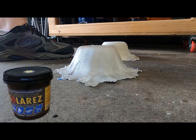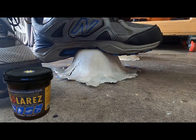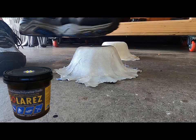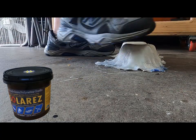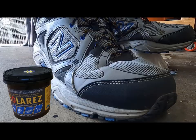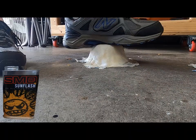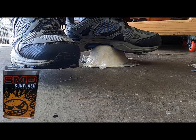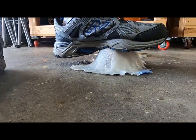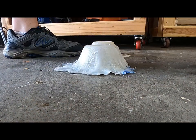Let's do a strength test. I'm a great big dude and I've packed on some extra pounds during the coronavirus lockdowns — if these things can hold up my weight they're strong enough for just about anything. First up is the SolarRes. You're going to notice a crack, but that may be due to user error — that section only had one layer of fiberglass. This is actually the second time I performed this test; the first time I was wearing flip-flops and the SolarRes held up just fine. Next up is the Sunflash. I did a little better job building this one and it held up better. Both samples had a little flex in the flange area with one layer of fiberglass, but the parts with two layers did just fine and held up plenty of weight.